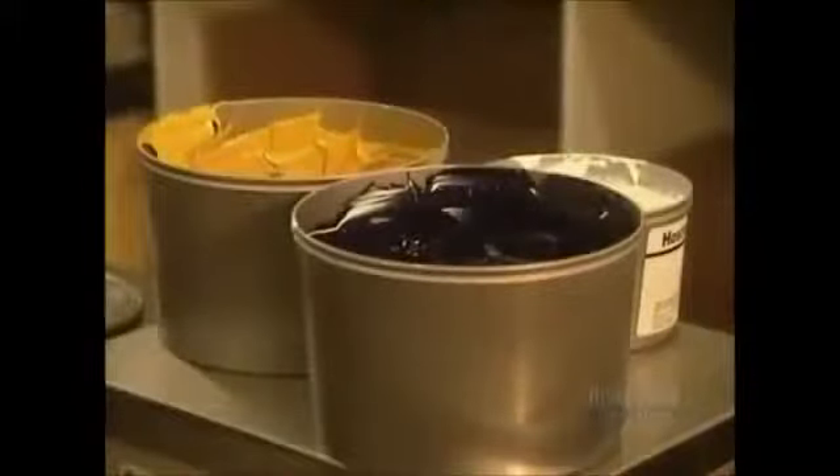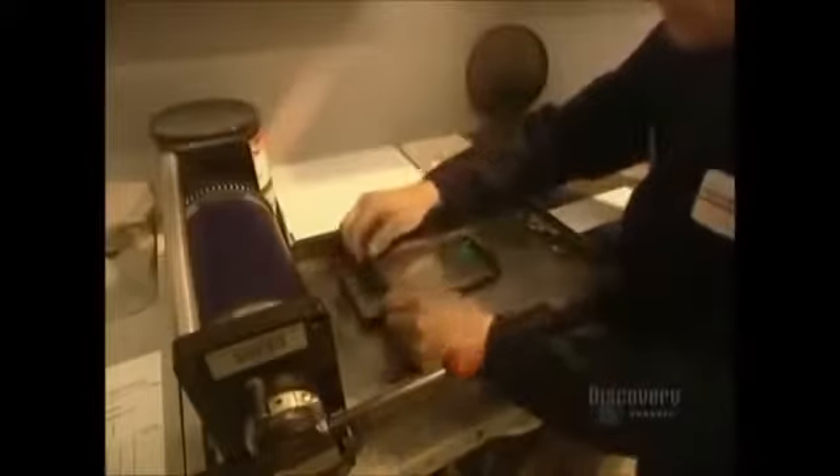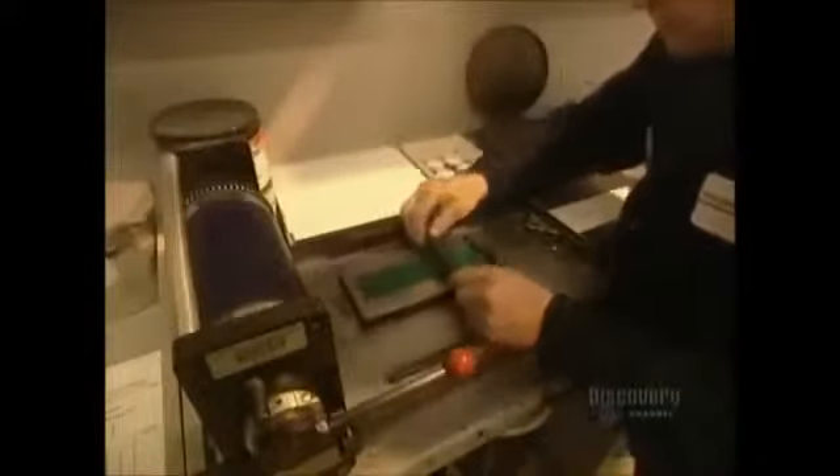Printing involves ink, and it requires selecting the right one. If the desired color does not exist, it has to be made up from a mix of various other colors. An ink trial is done with a spatula, and using this small manual press, color ink tests are done. The ink is spread onto paper and the color compared with the one called for by the customer. If the two match, the presses can be started up.